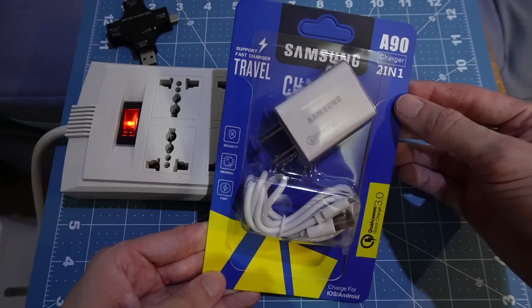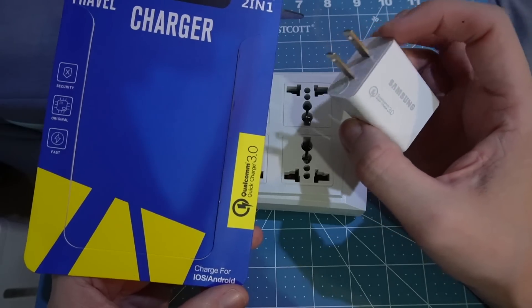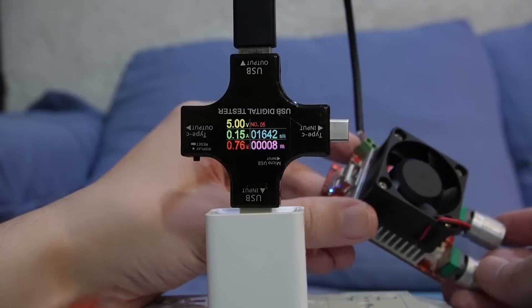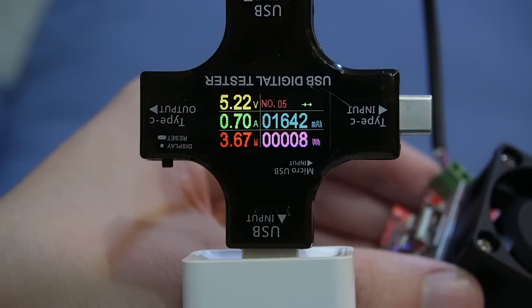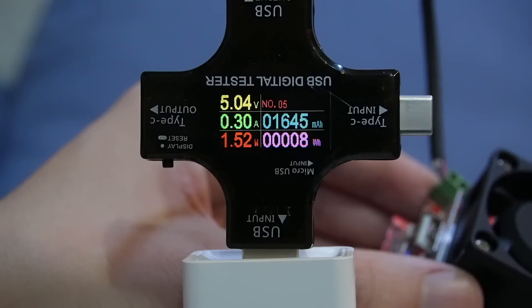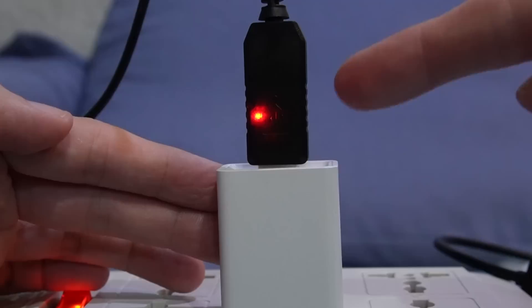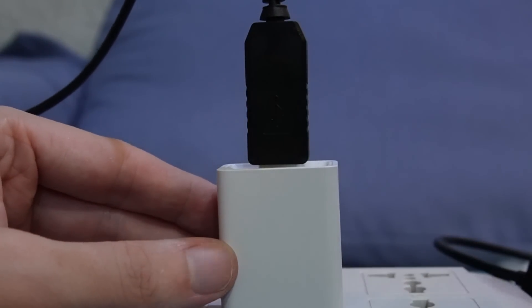Very, very scary, but we're going to test them out. We'll start with this charger, which claims to be from Samsung. They claim that this can output up to 2 amps, and they also say that it supports Qualcomm Quick Charge 3.0. We'll be using this USB dummy load to see if it can really output the 2 amps that it claims. So that's half an amp — we're now approaching 1 amp. It's starting to flicker. That's not a good sign. And there you go — it turned off once it passed 1 amp. So actually, this charger can only output 1 amp; it does not support 2 amps. And now we'll check if it supports Qualcomm Quick Charge — it did not. So it does not support Qualcomm Quick Charge.